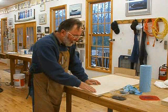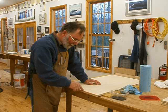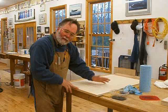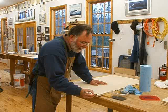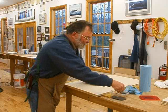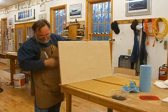The shellac on the maple that's going to be stained will help the stain penetrate more evenly. I'll do several coats out in the field until I get some build up, and I might even move up to a one pound cut shellac for quicker build up. But I'm only going to put the one coat on the front here until I've stained it, and then I'll put more finish on after that. I've got one wash coat of the half pound shellac everywhere on this dust divider. Now I want to stain the bull nose edge banding I put on here. This part in the front will be slightly visible between the drawers, so I'm just going to stain that part using a small acid brush, using my fingers as a guide, then wipe off the excess and let it dry.